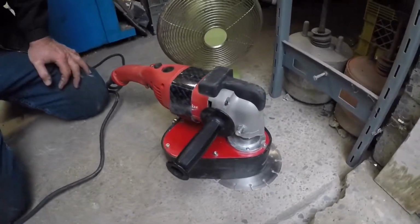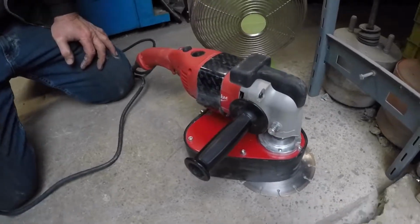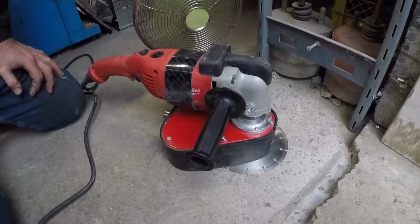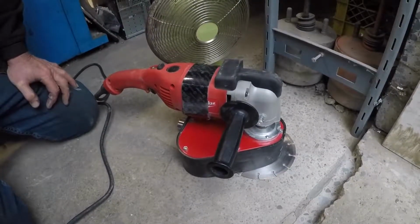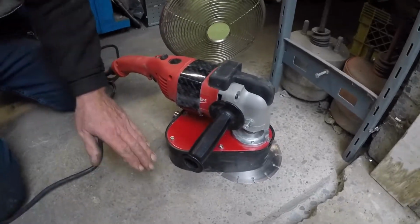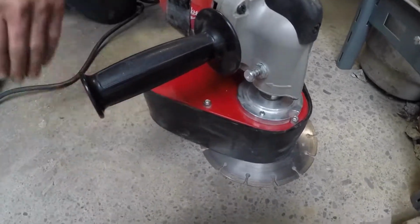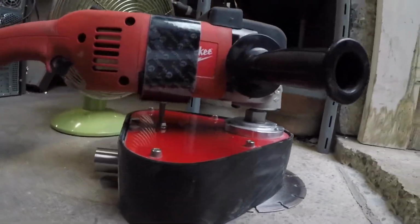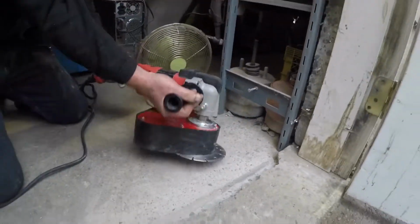So Ron, this is the MG4 grinder, hand grinder, which you have turned into a plunge cutting grinding machine as well. Yeah, it's a plunge cut. It's beautiful. So the blade is right flush on the concrete. So it's fantastic for lippage removal, for any trip hazard that you have. It works so incredibly. And I'll just show you the bottom.